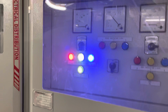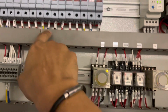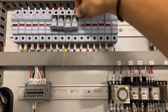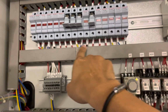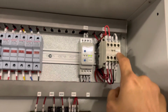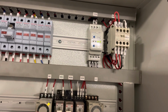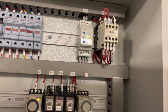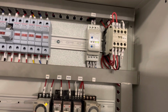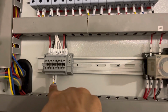Here we have another EMSB number 7. We're going to test again this round. We're going to use another method in which we trigger not the red phase but the yellow phase, as this controller contactor is using the red phase, which we don't want to be released. But if it doesn't release, then the X1, X2 cannot engage under closed circuit, which is using normally closed contact. However, we're going to test and see. It's using the X1, X2.